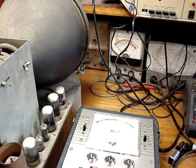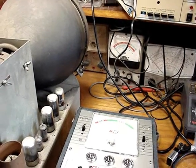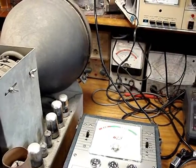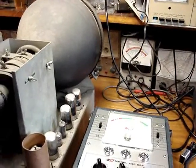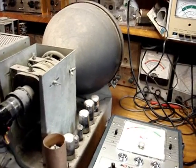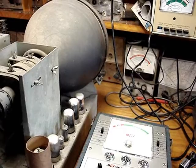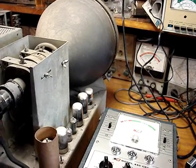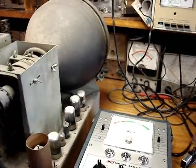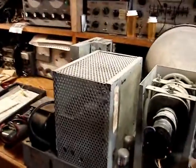Emissions go just to the low end of good. So conceivably I could get a picture on this CRT, but the CRT is not very good. That isn't an issue with me because primarily I would want to restore the set to where I could demonstrate that it gets a picture — it's not going to be a watching set. But I'm not sure how far I'm going to go along with this set because of this power transformer issue.